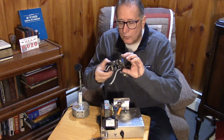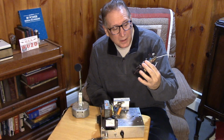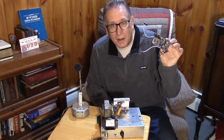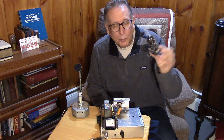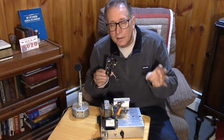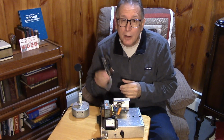Putting everything on this one little board kind of turned out to be a disaster. It's very difficult to rework and optimize circuits once you've got it on this impossibly tight board using this perf board type construction. So it needs to be deconstructed into small bite-sized chunks, and you really need ground plane.